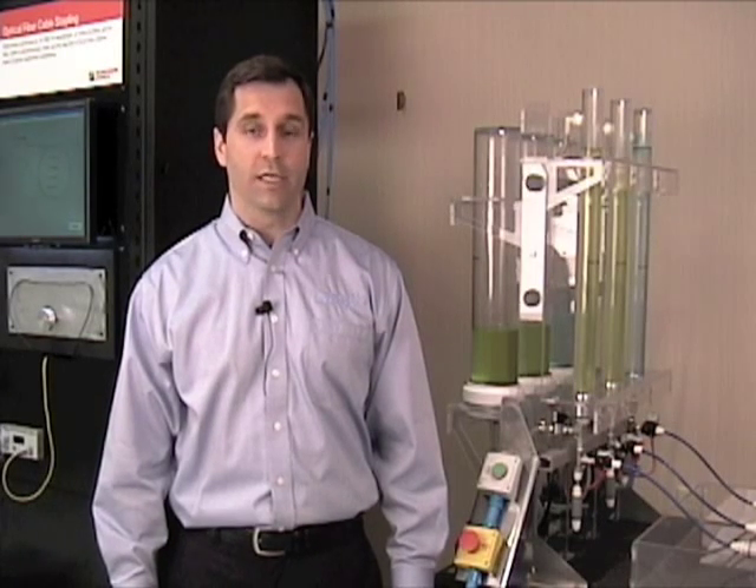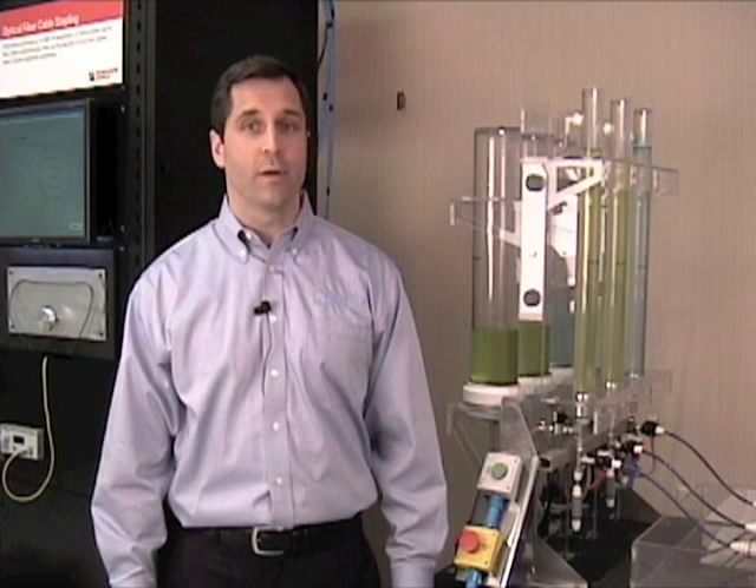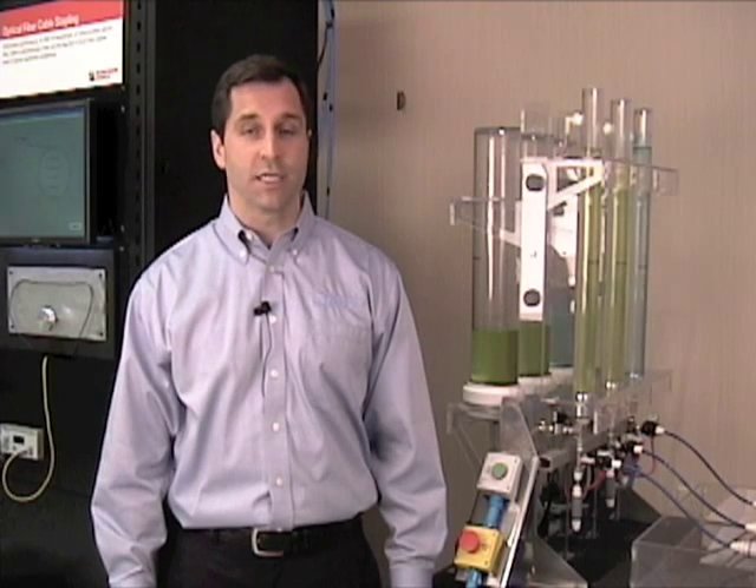In summary, we have just demonstrated that PFM gel and all-dry water blocking tapes do an adequate job of blocking fresh water from migrating down the tubes, and PFM gel does an adequate job of blocking seawater from migrating down the tubes. However, the all-dry water blocking tapes do not do an adequate job of blocking seawater. This might be an area of concern if the fiber cable is being deployed in areas where there is a concentration of seawater or other high-ionic water solutions.